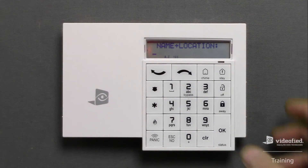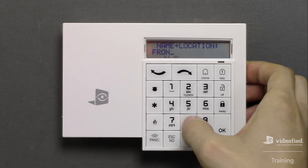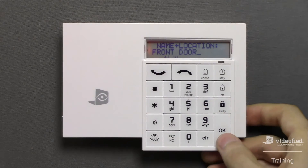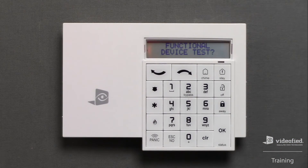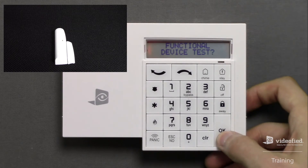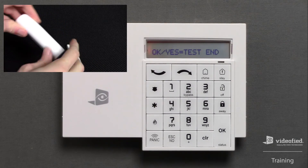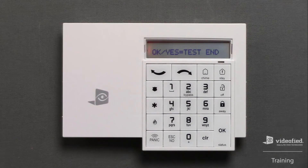Because this is a door window sensor, it will prompt us by default to configure this sensor as a perimeter device, so I'm going to say yes by pressing OK. Next, I want to assign a name to this device — I'm going to call this one 'Front Door.' The final enrollment step is the functional device test. This test is essential for door contacts, as it will determine the normal state of the device. Ensure the reed switch and magnet are aligned properly, then press OK to initiate the test. Separating the magnet from the reed switch will cause the device's LED to illuminate while in an open state, and the LED will turn off when the device is in its closed state. Press OK to end the test.